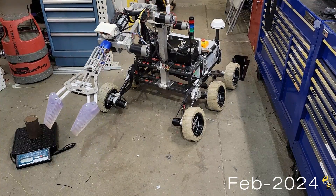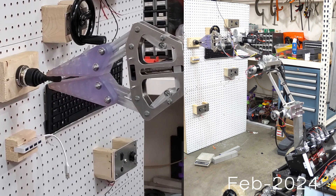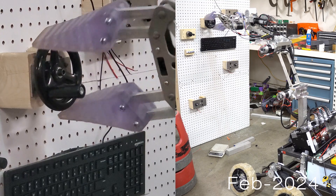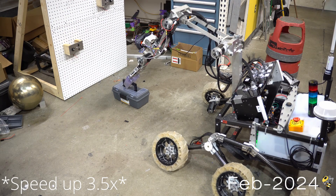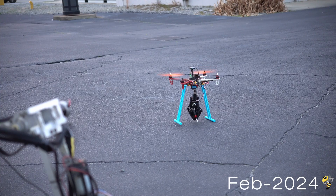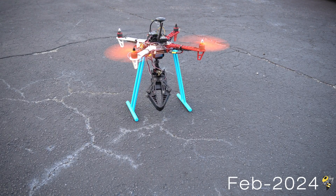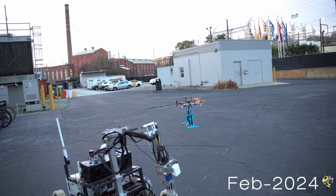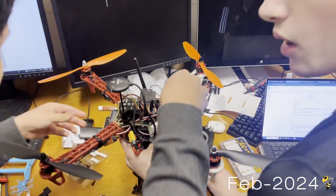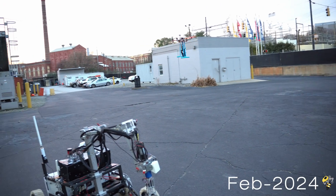Mounted on the front of the chassis is the 5 degree of freedom rover arm, which is used in both the delivery and equipment servicing missions. The rover arm utilizes a compliant gripping end effector, which allows the rover to grasp a wide variety of different objects with a maximum weight of 6 kilograms. To assist Wall-E in the delivery mission, our quad rotor drone Eve is outfitted with a 3 degree of freedom arm that can be used to reposition the camera as well as pick up and deliver payloads of up to 2 kilograms. Working together gives both Wall-E and Eve greater flexibility in surveying the field layout, locating payloads, and accessing objects in difficult-to-reach locations.